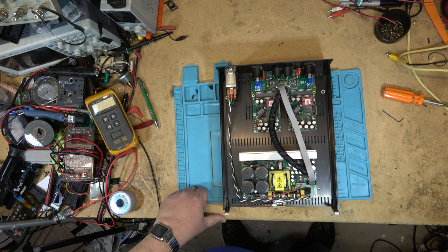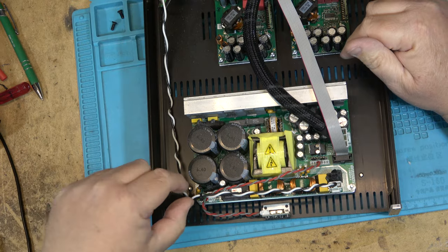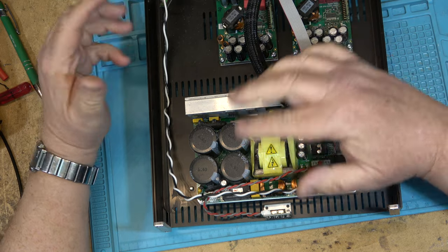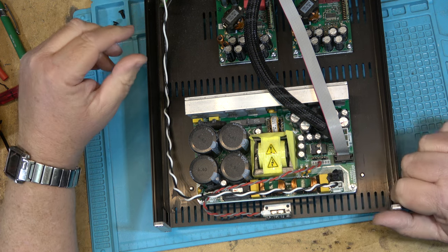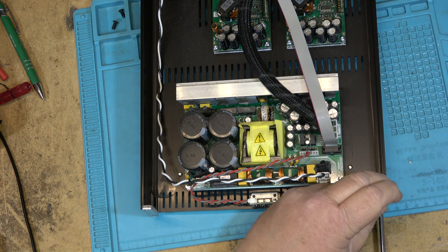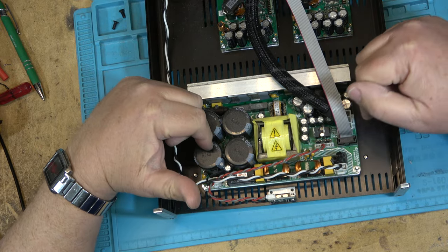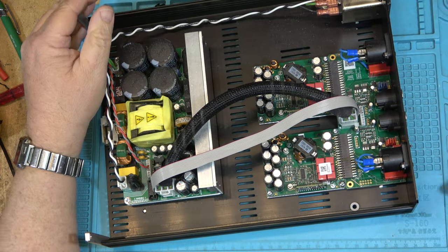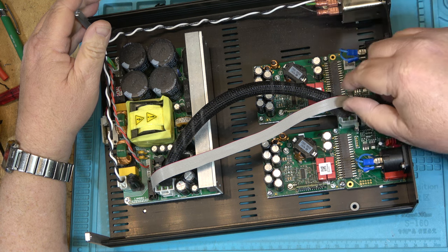Are we impressed yet? The board on the front is the power supply board. So our AC comes in through the black and white wires, rectified, and it'll, of course, auto switch. We've got our power indicator on the front here, and notice it's got a three-position switch. I don't know exactly what that three-position switch accomplishes, but this is our power supply. This is generating all the voltage that's going to go to the amplifier modules at the back. These are the amplifier boards. So you've got your right channel here, and your left channel here, and this is the power into it.